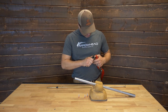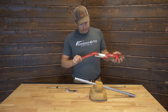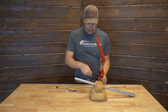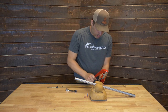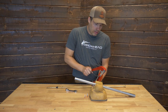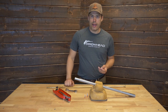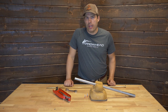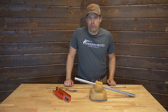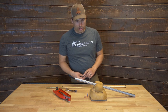We'll take the die. I expect to end up around 15 on this barrel, but to start with we'll go to 10. I like to run the bullets through three times — one time works, but the die setting will be different depending on whether you settle on a one, two, or three pass setting. The reason I like three passes: if you size a bullet with one pass and come back three or four weeks later, a lot of times there'll be some spring back and that bullet that fit really well is going to be kind of tight. Doing three passes seems to alleviate the spring back.